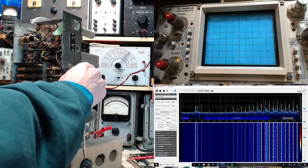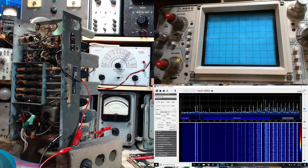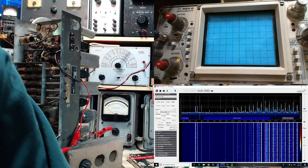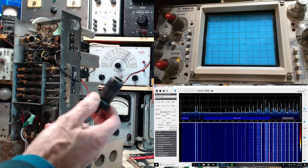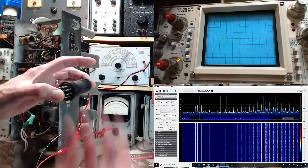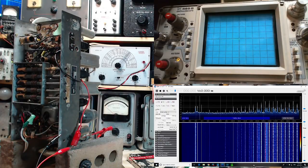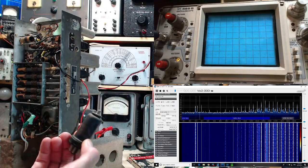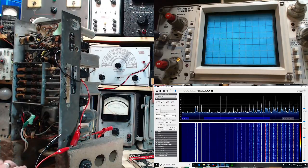So there's a replacement there. Now I have a bad one here I want to use. I've tested the 6K8 that's in the radio — it's very good. The reject point on my tube tester is 780 micromhos, and this thing's reading 1500. I have another tube at 1500, but I have one at 780 — that's this one. So we'll pop in the 780 when we go to do the experiment. 780 is as weak as these tubes should get and still be used according to my tube tester. So this is right near the bottom of its capabilities.